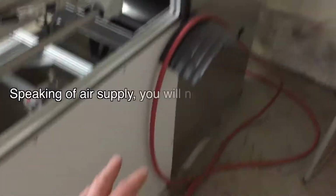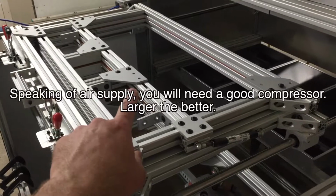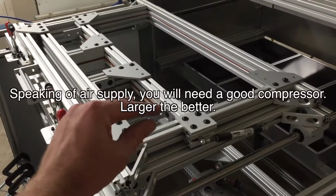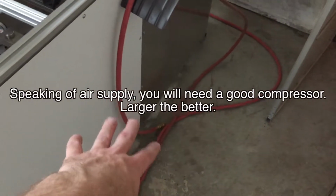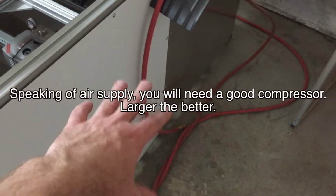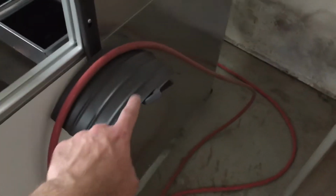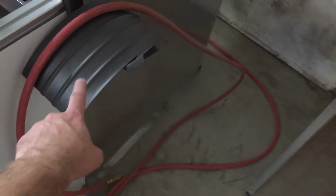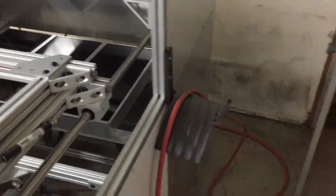Next thing is we always want an air supply next to the machine, because you can use the air to cool down the part that's on the machine. If your mold is very hot and you don't want the plastic to bubble up again, you use a supply of air to cool the part, but also to clean off your mold or your buck if it's got debris on it. You want to have air supply handy. So we have this, not neatly right now, but we're not done for the day yet. Wrap up your hose and everything. It's a regular garden hose thing, screwed right into it.